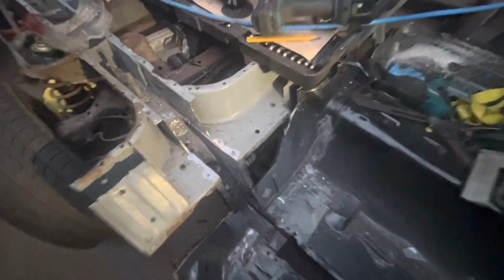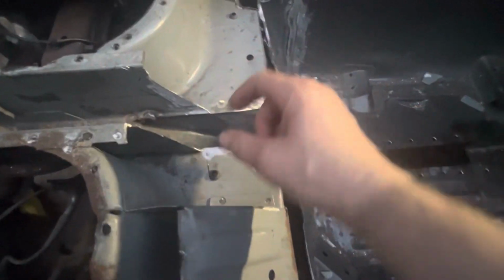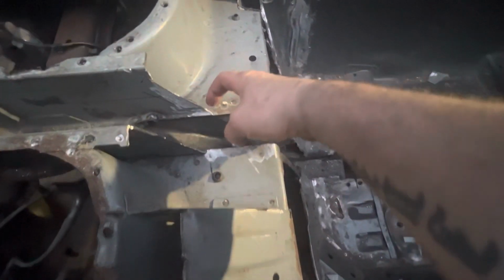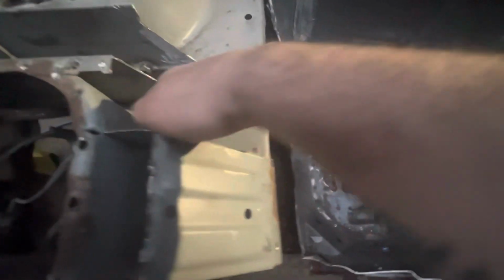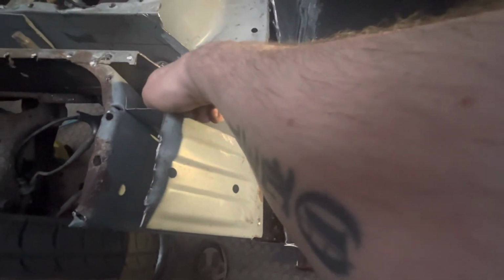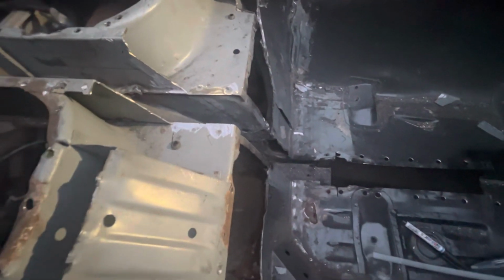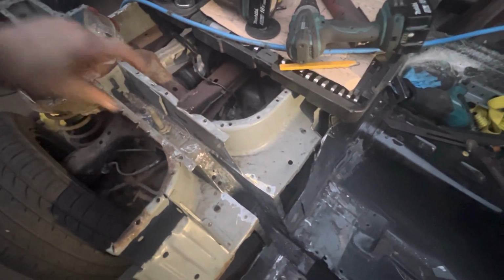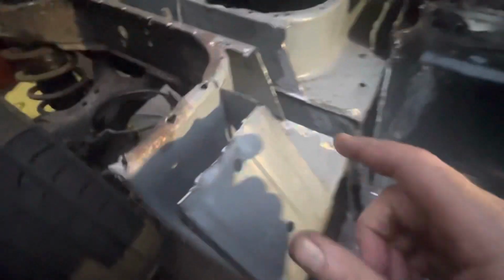Move the light, and I'll clamp them because they've got a little bit of give around the new box section, and then we can decide afterwards. I'll just seam weld them up to the box section on both sides, and potentially, in fact I will probably do the bottom, but I might leave that bit because them chassis legs are definitely staying. I'm just not sure what's going to happen with this. I think I'll probably be keeping it